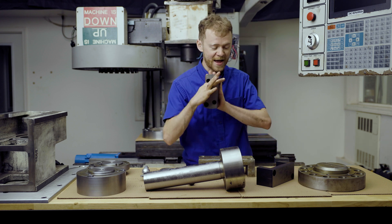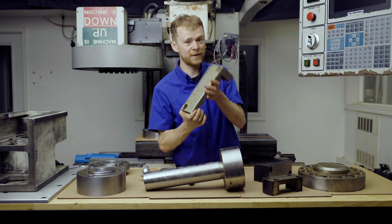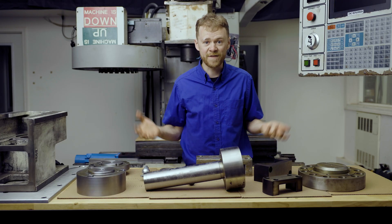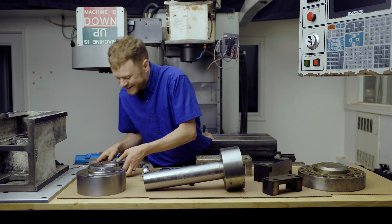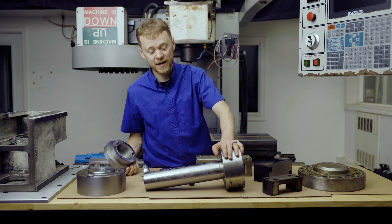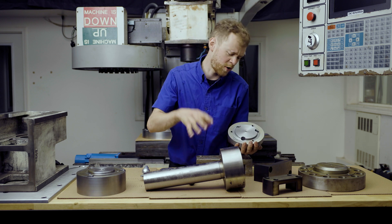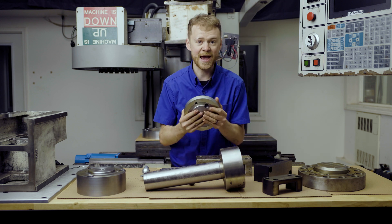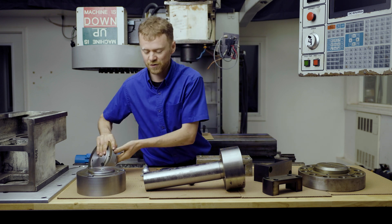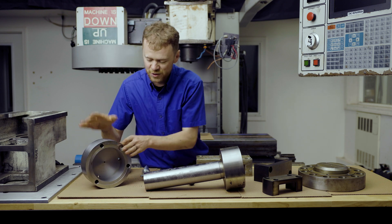We have this wedge tool for A25 and A26, we have one for A28, and we have this big boy for A211 for big, big lathes. Now, what if your machine has an A25 spindle? I have an adapter — because we used to have to run around with an A25, A26, and A28, and the test bars were solid and heavy. We thought about it for a long time and made an adapter, so now you can use the A26 test bar on an A25 spindle nose, and the same thing if you want to use an A26 test bar on an A28 spindle nose.